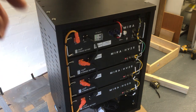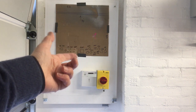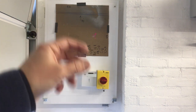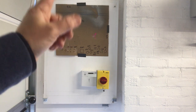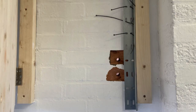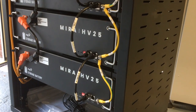The other thing we've got done is the switchgear. We managed to get this switchgear on the wall. The one on the left is the generation meter — it shows you what you're generating, which more relates to if you have a feed-in tariff. I don't think that's applicable to us, but they tend to fit one anyway; maybe there's a legal reason. Then the AC isolator over there disconnects the AC side — either feed-in or out to the inverter — so you can isolate it. Those have gone in, the holes have gone through the wall, and they've got some of the conduit going up the side of the house because you've got to go over through the loft to the other side.